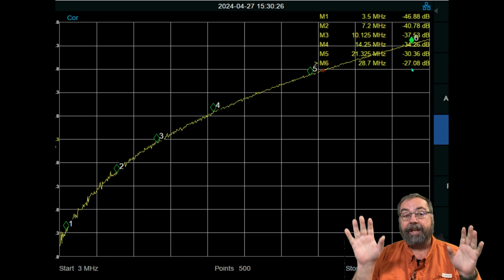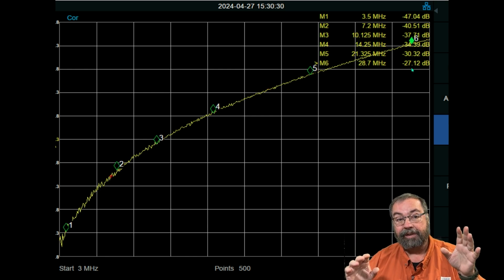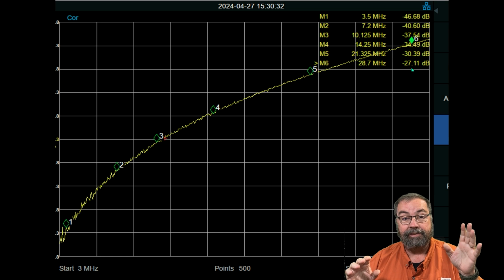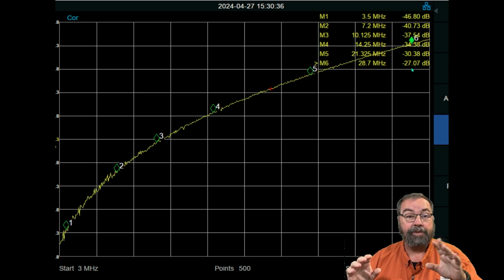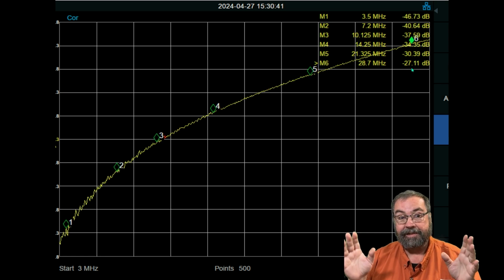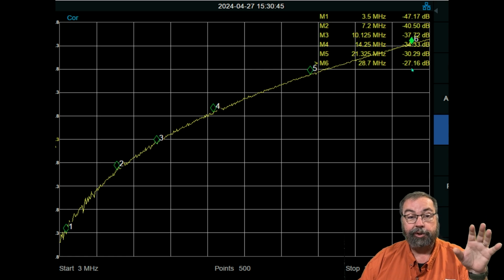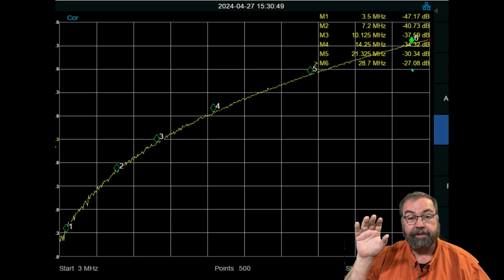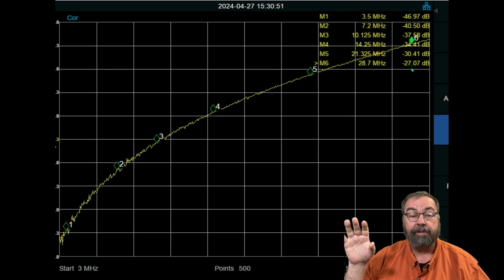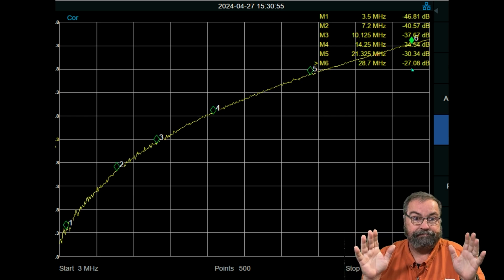So if that evidence is absolutely true, and we have 46 dB of isolation here, then that would be 66 dB, which is well over 300 watts. But that is not anything I've read anywhere that I could cite a source. That is a guy on YouTube quoting another guy who does a lot of serious high-end radio testing and knows way more than I do by far. So your mileage may vary.